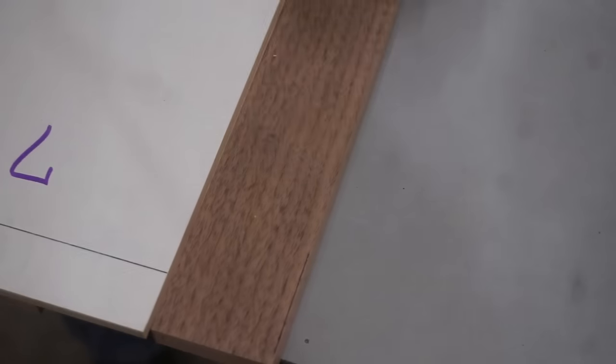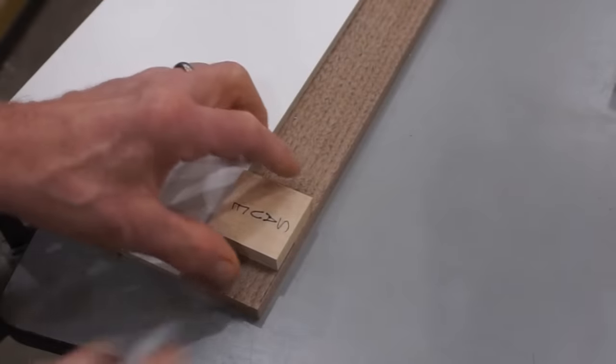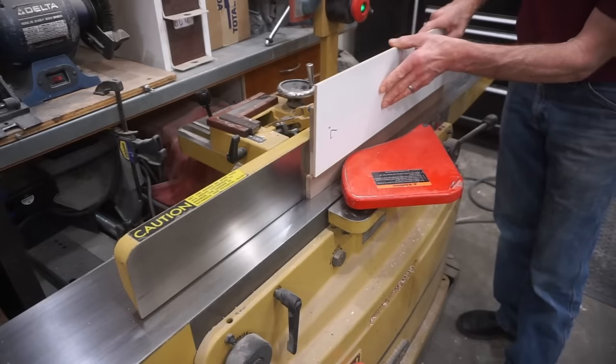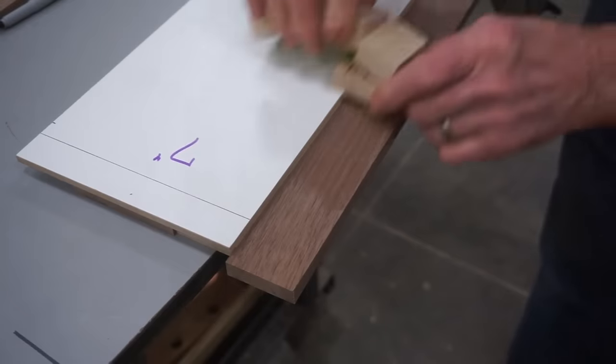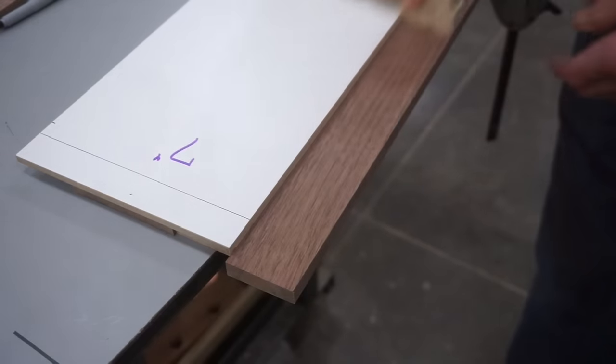After making the cut, you can see that that bottom strip is still just a skosh wider than the exact width I need to end up with. So I'll put a mark that shows the excess width and carefully trim it off at the jointer. Now that bottom strip is precisely the right width at 1 7/8 inches for three lugs of the box jointed corners. As it turns out, that wasn't so bad after all.